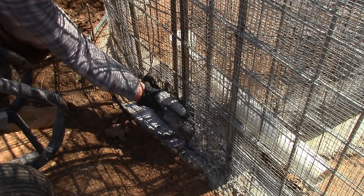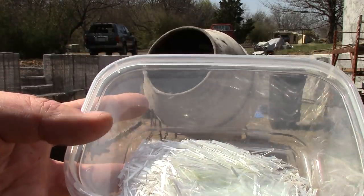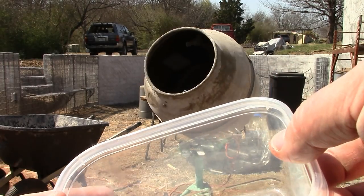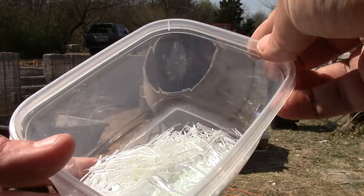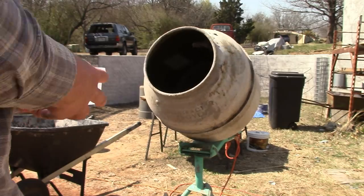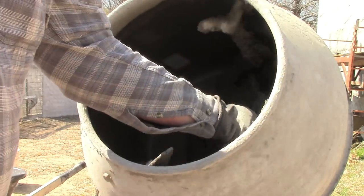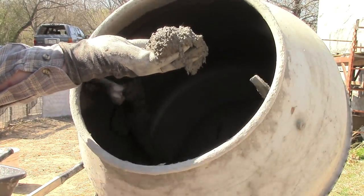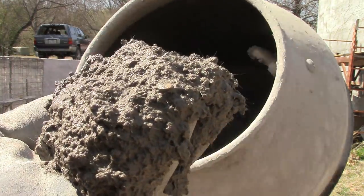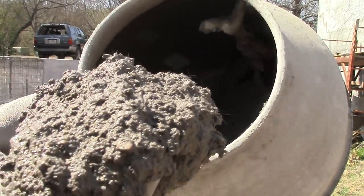Well, that's it for this episode. Next time we're going to be throwing mud and doing fiber-reinforced ferro-cement. I don't know if I need to break the fibers up or if they break up on their own — I'm just going to dump them in. The data sheet said they disperse perfectly all by themselves. It's a little wetter than I typically like but it's holding its shape pretty well. Those fibers — do you see the sparkle? They really have dispersed everywhere, so I think we're good to go.